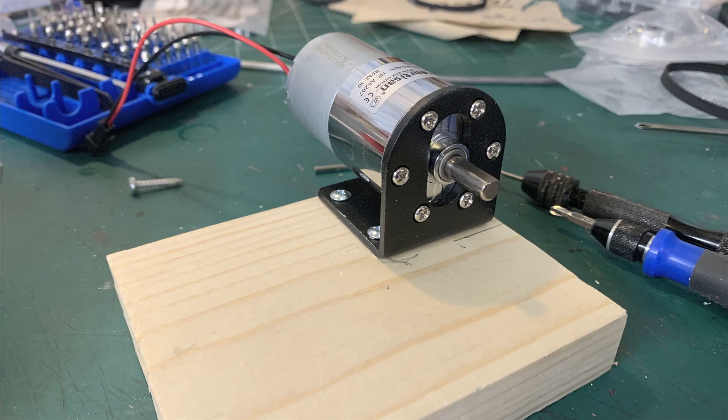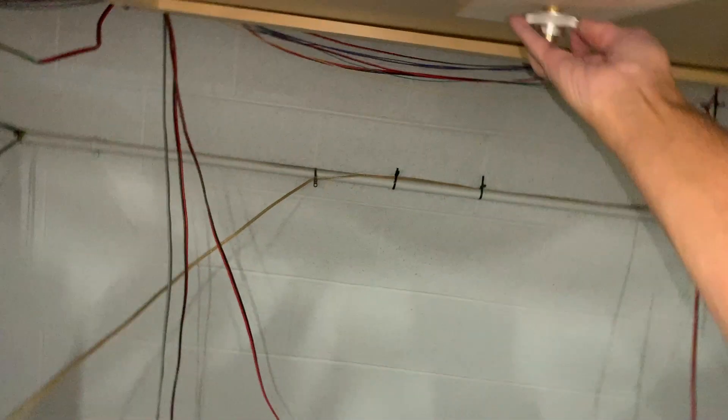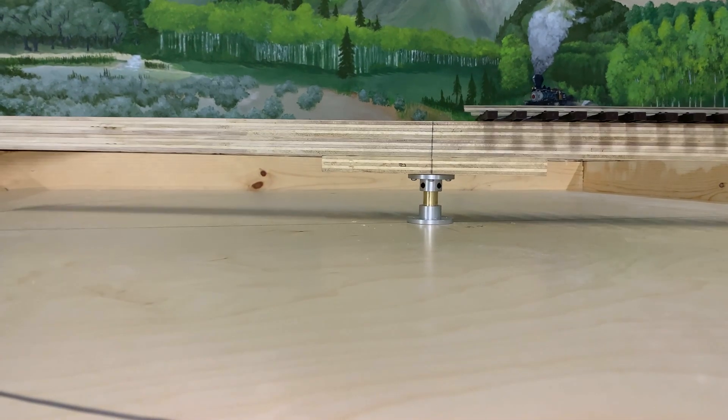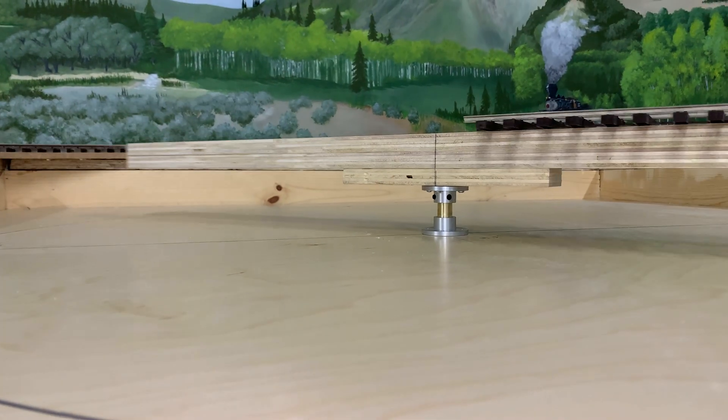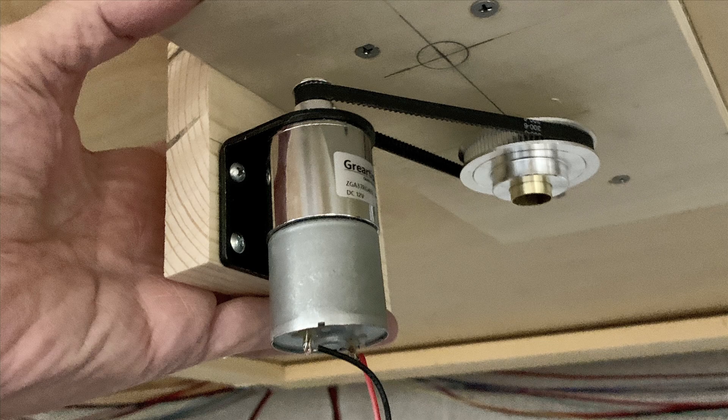I can also buy different motors with different gearboxes — again this is a 10 RPM motor but it's available in many speeds. Once I have this all worked out I'll put a complete parts list in the description on the final video, but first I have to figure out the appropriate pulley sizes, belt sizes, and so on. Next up is to temporarily mount the motor, fire it up, put 12 volts to it, and see how fast it actually turns the turntable bridge. I have several different pulleys and belts on hand — hopefully, as Goldilocks said, one of them will be just right.